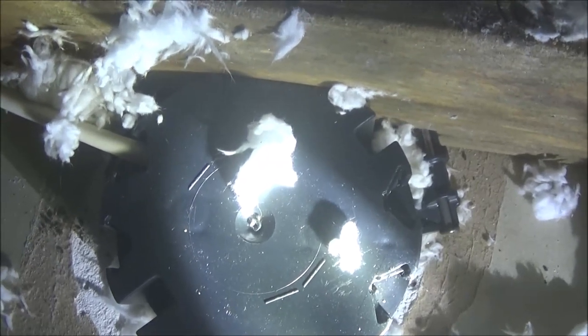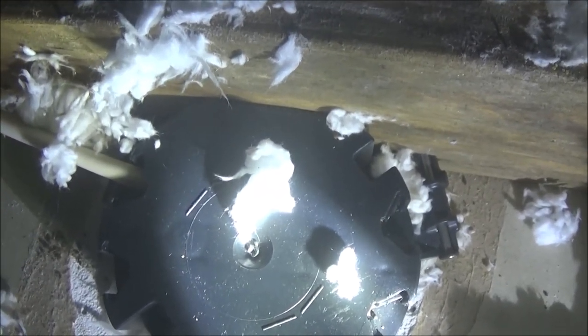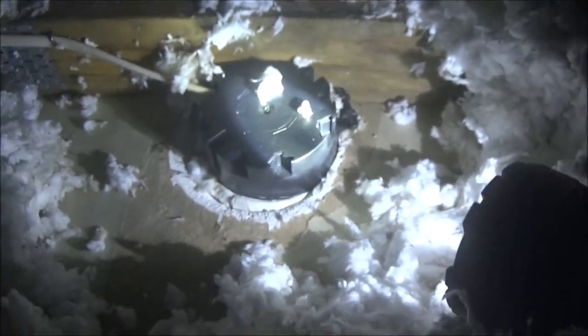Okay guys, so we made it back here. There's the bathroom over there. And the camera's gonna fog up. I can't film this for you because I didn't bring a tripod. But what I'm gonna do is I brought my hammer and drill up. Okay, so I gotta see these boxes are nailed on right there, one over here. So I'm gonna pry that box off of there and I'm just gonna drill right down beside this, and hopefully that'll cover any hole that might be down there. So let me get to that and I'll be back with you.